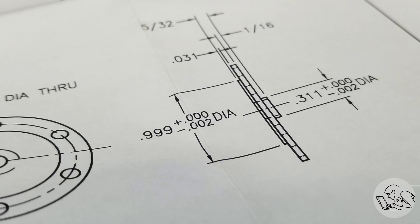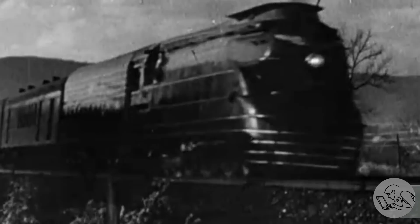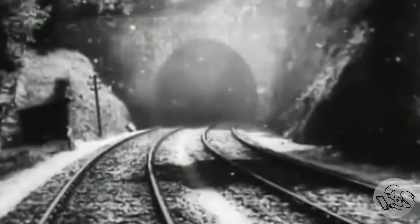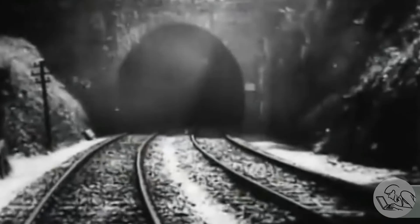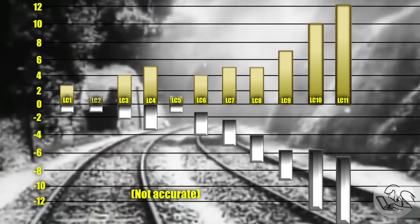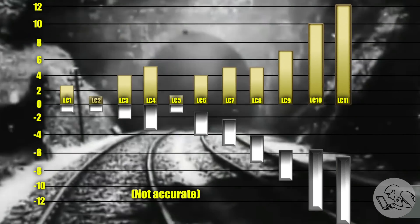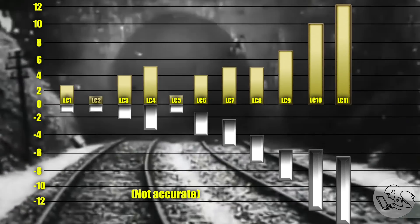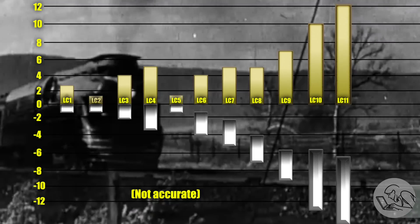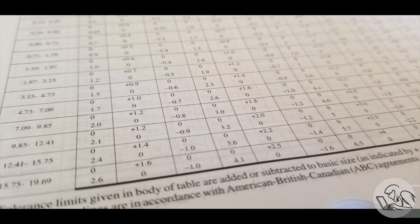We need some common nomenclature to discuss how well two parts fit together. We typically do this by speaking in terms of a shaft and a hole — a theoretical perfect shaft and a theoretical perfect hole — and we want to know what size those two things need to be to fit together certain ways. Various graphical representations of these standards exist; this is a typical one from the ANSI system, showing how oversized the holes or how undersized the shafts can be and still meet a particular standard of fit. These charts are typically calibrated to a one-inch diameter for ANSI, and you'll find a chart in Machinery's Handbook showing how to scale the tolerances up or down depending on the size of the part.